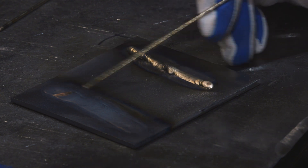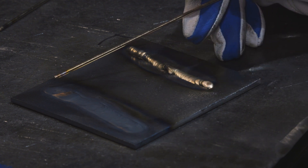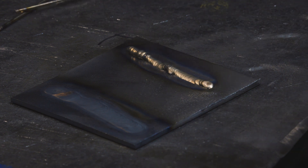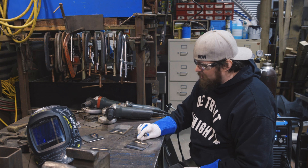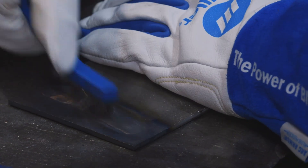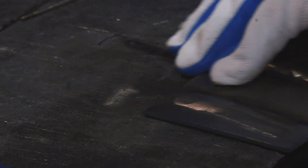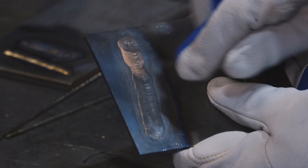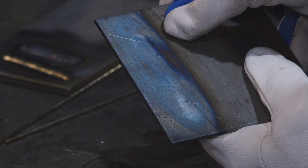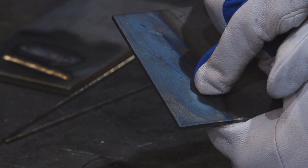Now if you get it way too hot, this is what happens — you get it kind of smutty and dirty, and once I clean this off you'll see that there are actually cracks throughout the base of the weld. It cracks all the way through and pulls the whole base metal apart. It's a hot cracking rod, as they would call it. So you don't want it too cold because you won't get any fusion, and you don't want it too hot because you'll end up with cracks. You can see there's a big divot, there's a crack, and there are little fractures all throughout the weld. On the back side there are also fractures visible in this area, and a couple others are hidden along the grain.